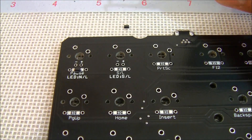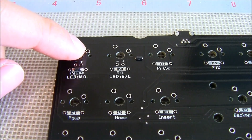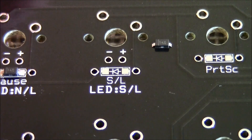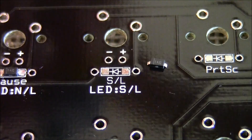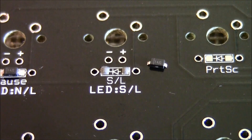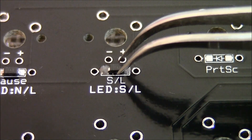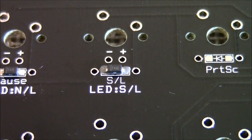Here's a different PCB that uses the same type of diode. Since this one doesn't already have solder on the pads, you can add solder paste and then use hot air to solder it. I already did one here, so I'll do this next one right now — I'm going to solder this little guy onto these two pads using solder paste.